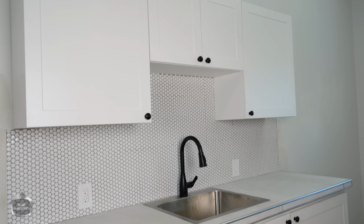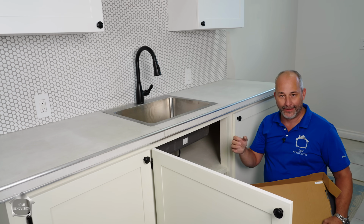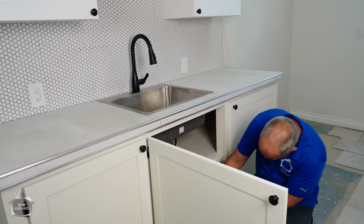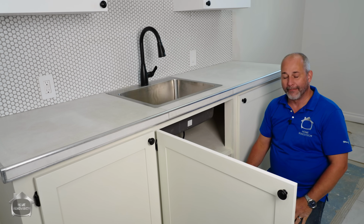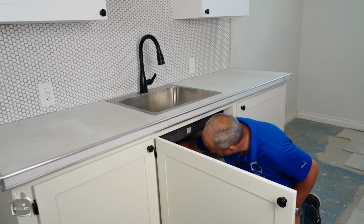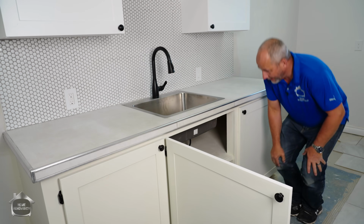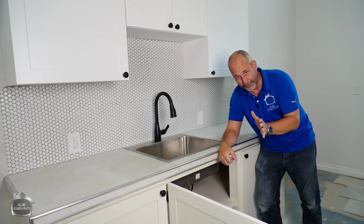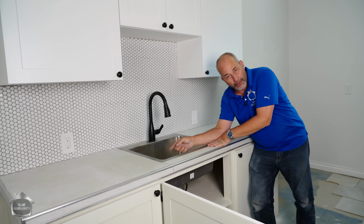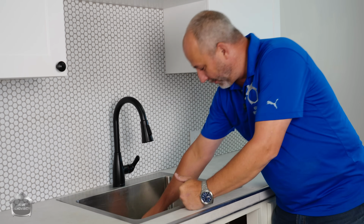Just a note, when you're doing water testing, every joint that you made is a possible leak. So take a piece of cardboard or some paper towels or something, stick it underneath the P-trap, okay? Because what you're going to want to do here is a two-stage test. You want to turn the water on first to the faucet, hot and cold, all right? And don't just connect just the cold or something and then test the faucet. This is a mixing chamber and it'll come back out the hot water line and cause a flood. Just a note.